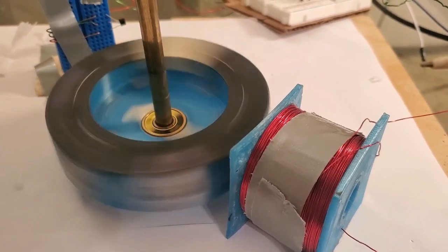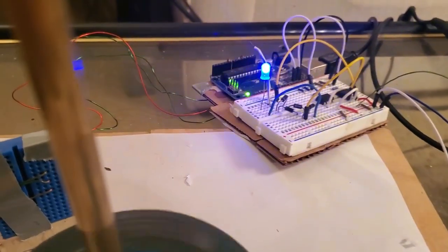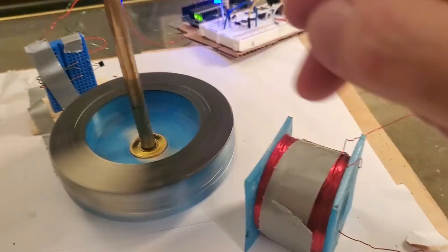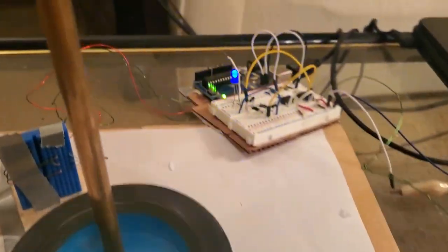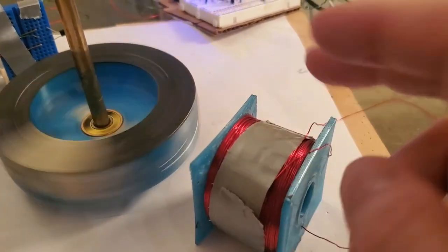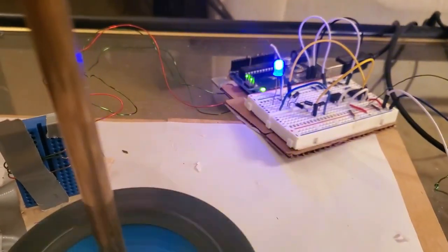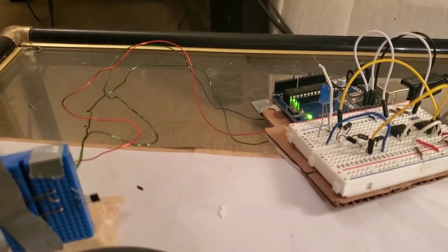Now I've actually turned it down to three volts and put the LED in across the bridge rectifier. So now there is a load, both with the magnet spinning past and also because you're putting power pulses into the coil — that's a changing magnetic field as well, and we see that. For a while I thought that everything going on was just the pulses of power from the power supply into here, and that this was a minor effect. But this is what I showed in the last video — I'm going to turn the power off now. Powers off, and we still got some light coming out there, don't we?